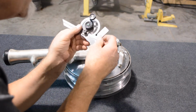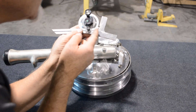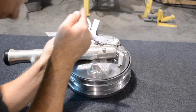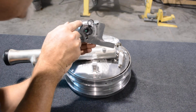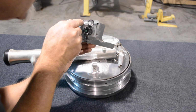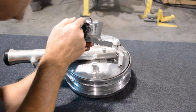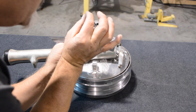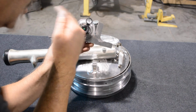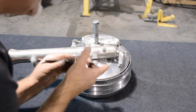this is a vernier protractor I've had for a bazillion years. A vernier has every angle and then every division of angle, and you have two scales, and depending on what lines line up on each scale, the 0 is your master, and then you go off of the other lines, which are slight increments that will tell you within minutes of degrees. Now, do I trust this to minutes of degrees? No, but you know, it's still very cool.